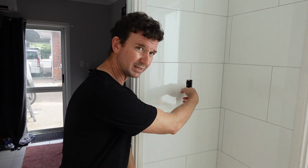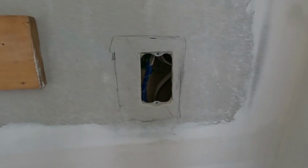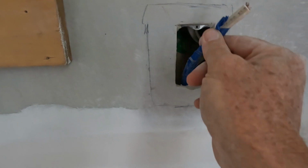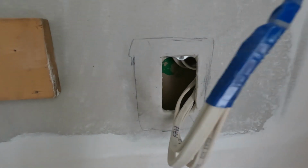So all you sparkies out there cutting fibre cement sheet to do nooks for this sort of stuff, all right, for your light switches and that, get a multi-tool with a mortar and grout blade. It will take some time to cut and it does create some dust, so make sure you mask up, but it really is quite safe. It feels safe to be able to use it.